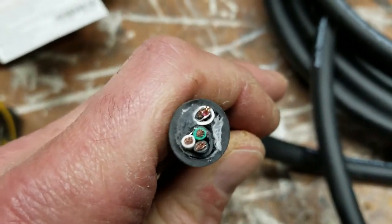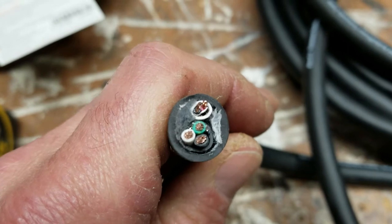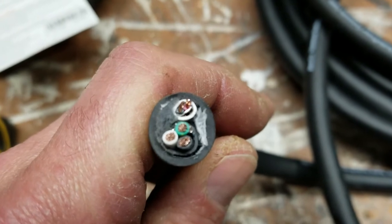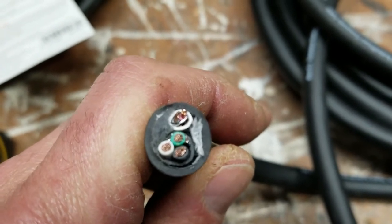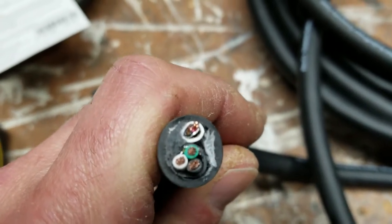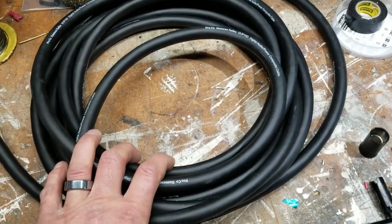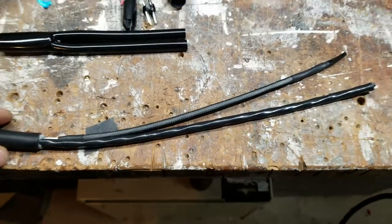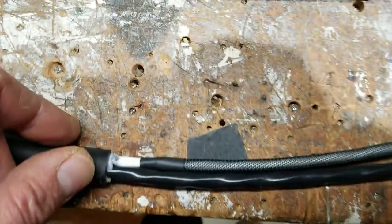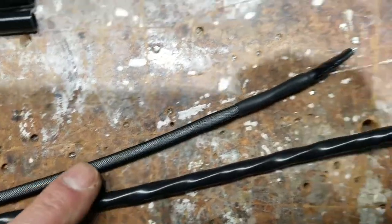As you can see, there's quite a bit of cord in there. There is a shielded three-way AC power with a ground and a drain on the shield, which is an extra ground. And there is a pair of audio cable in there — a twisted pair. I've already cut this into two 25-foot lengths and stripped off exactly 12 inches of the outer sheathing on this end. I've coated the audio cable in quarter-inch TechFlex.